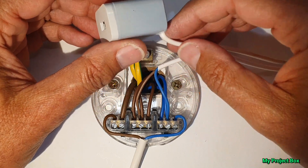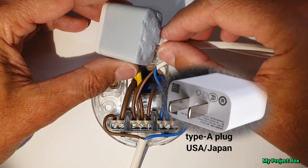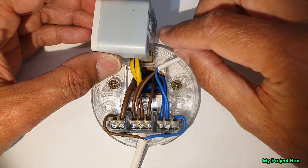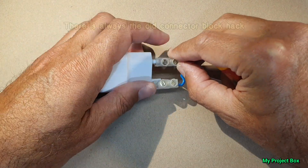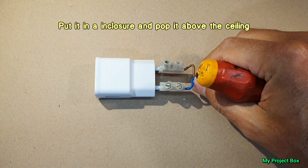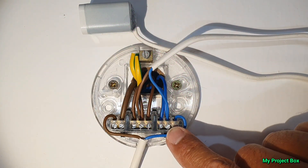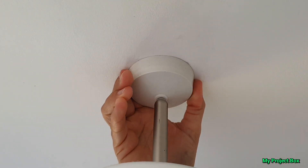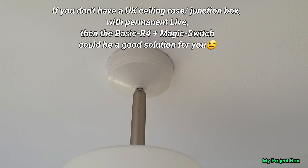I've simply hacked an American/Japanese style USB phone charger that I can't use here because of the flat pins - I've cut them off and soldered a bit of flex to it and just put some epoxy over to make it safe. So this is a bit hacked up but it does work and it's nice and small. You can use the euro adapter thing that I showed earlier, and I'm certainly not going to judge you if you use a connector block - it works, it's not stupid if it works. But yes, you've got these two terminals here and it's quite convenient to get a permanent live feed. Unfortunately that is not an option for everyone, but it is an option for some people living in the UK and you can put your power supply above the ceiling and that will solve your problem.